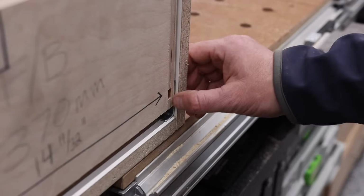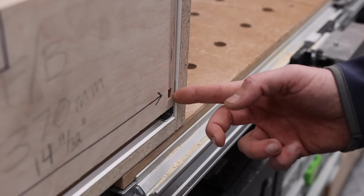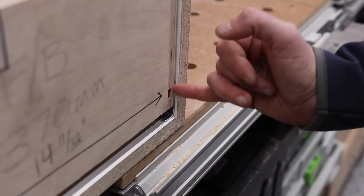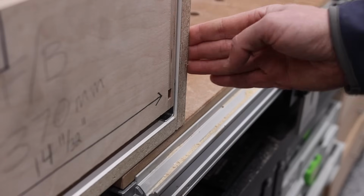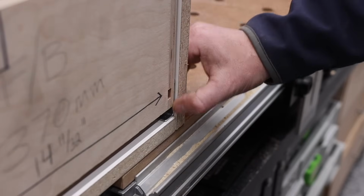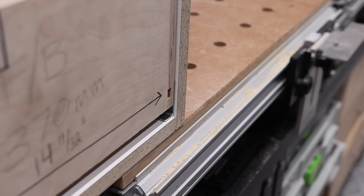And then finally, I just wanted to show you, so when you're installing these, this protrudes past the edge of this about 1 millimeter. Now, if you use thicker material, like 5/8 inch, I always use 1/2 inch, it's really easy to figure everything out because it's pretty much just right at the edge of this, right? So now, imagine putting a drawer front on here, it's always going to have that, see how it wants to pull it back? It's going to ensure that that keeps that drawer front tight against the face frame. Also, you may end up making some adjustments that shift it, right? So you have that little bit of adjustability.